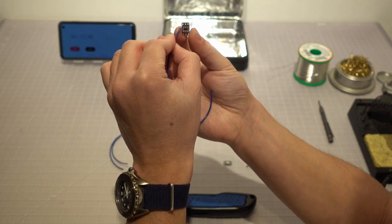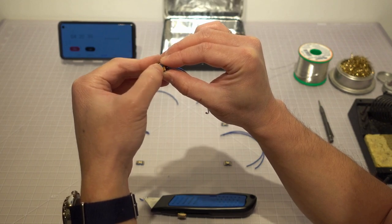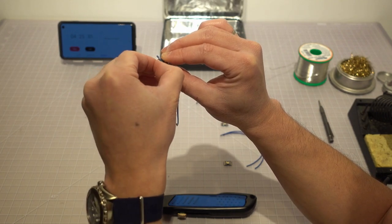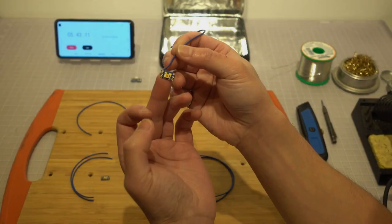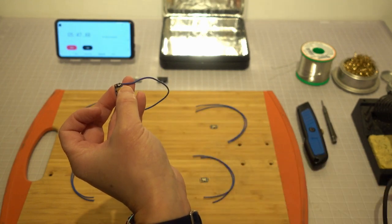After the wire is inserted into the top left corner through hole, bend it 90 degrees downward so it can touch the middle through hole on the breakout board. Use a soldering iron to solder the wire to the middle through hole.